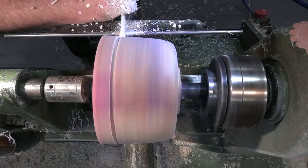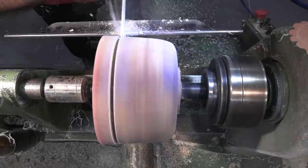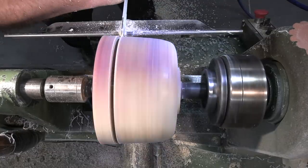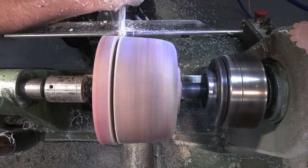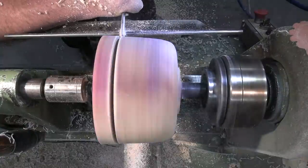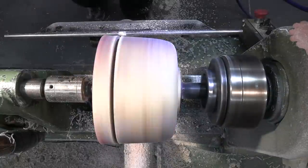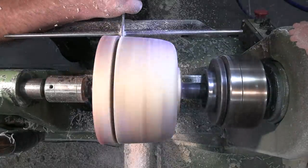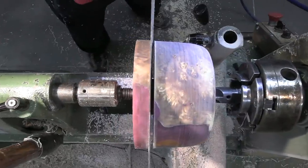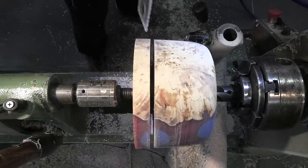Here I'm using the 3/16 inch parting tool from Crown. I do have a thinner parting tool, but to work with it far off the tool rest like you see me eventually getting to here can be quite tricky. One time in the past it actually got grabbed out of my hands, so I'm not a huge fan of it — even though we're going to be losing a fair bit of wood here. I think this is the safer way to do things, and just finish things off with a handsaw — there's no need to get too aggressive.